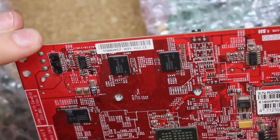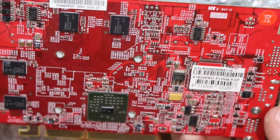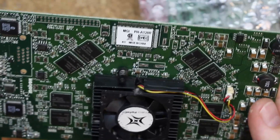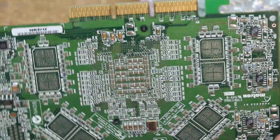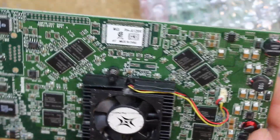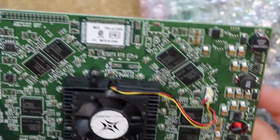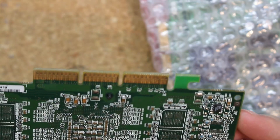I think this first package has something more interesting. This is the X1600 Pro — again with a bridge chip, so chances the bridge chip is our issue are pretty high. And a Matrox card — this one only has 3.3 nanosecond memory. I kind of like Matrox cards for salvaging memory because they are some of the cards where you can find the highest-specced memory, except for the GeForce FX cards obviously, but those are really rare.